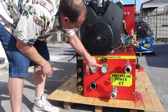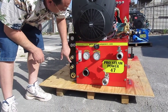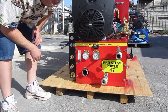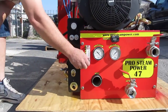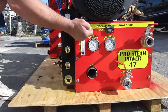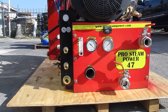This is your hour meter — it shows you hours and RPMs. You push that, it shows RPMs, and it sets it at hours. This is your chemical injection. You've got a hose back here you put into your chemical bucket — your solution bucket. Then you open that up and that needle comes up while you're cleaning carpet, when you're pulling the trigger. And when you're done you shut it and close it.